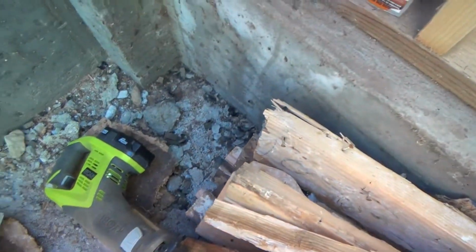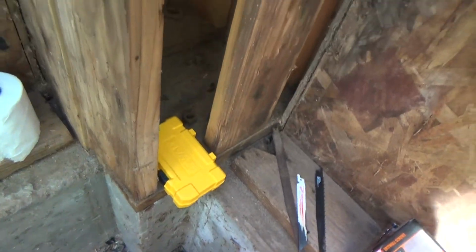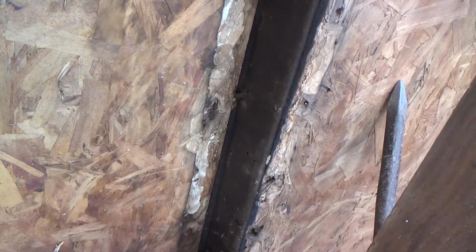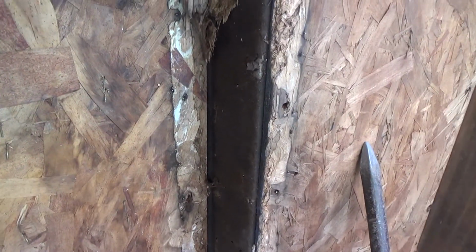Okay, so not only do you have to work efficiently, you need to work thoughtfully too. See what type of tools you have, see what kind of blades you have, and before you have to run up to the store and get another 9-inch blade, you could have used your 6-inch blades for this 2x6, and you would have saved some time and money, taking off from the job or not finishing your project because your blade was dull and you didn't know what else to do. Okay? Keep thinking as you're working.